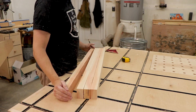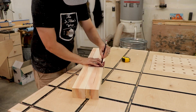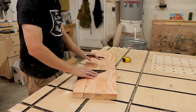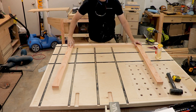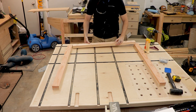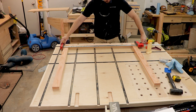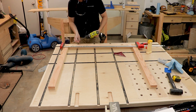To start off I cut everything down to the proper size based on the build plans, then gang marked all of these studs to where the stretchers on the sides will go for the side panels. I added pocket holes to each one of the stretchers where they'll connect to the legs, then used glue and pocket hole screws to set the stretchers in place. I used a clamp as I always do with pocket holes because they like to move, and checked for square along the way.